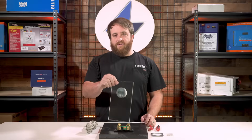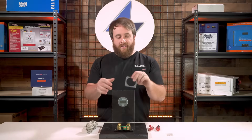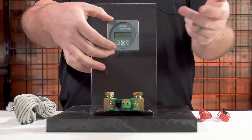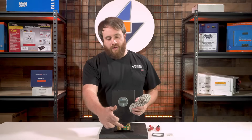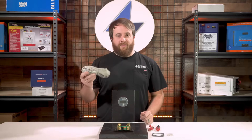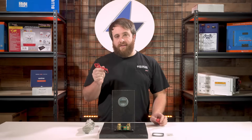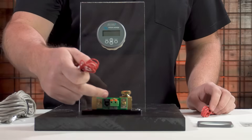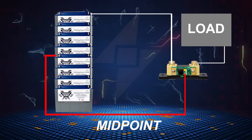Now we're going to show you how to hook it up to your battery bank. We've got a display built here. You can see I'm using the ring to mount it because I'm able to access the back of it. If you can't do that, you can use the bezel instead — it mounts to the front and holds your display against the wall so you can plug in from the back. The communication cable runs from the shunt up to the back of the display, and you get plenty of cable to mount the display a great length from the shunt if needed. You've also got your power supply wires — one connects to the positive side of the battery bank and goes to the B1 terminal on the shunt. There's also an additional accessory wire for monitoring things like your starter battery voltage or midpoint voltage if you have a large battery bank and want to ensure the center isn't deviating much from the ends.